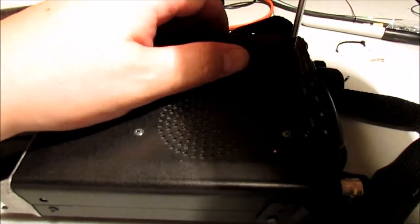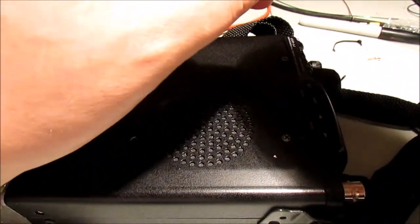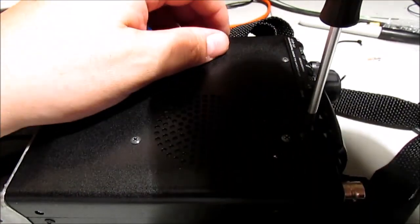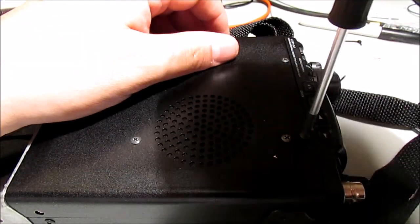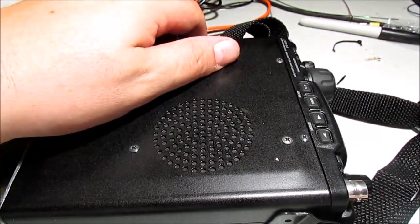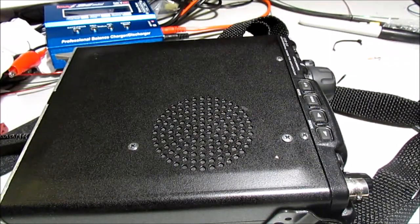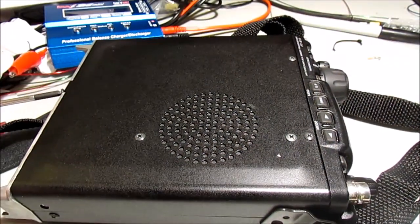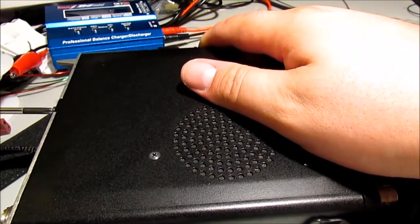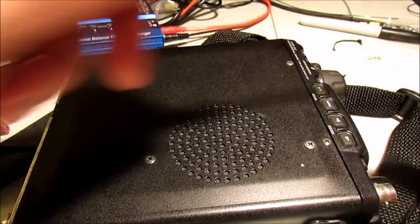Generally with screws, I have a tendency when I go to put them in to go backwards first and listen for a little click. I'll demonstrate that here. Like I'll put it in, I heard a click, then I'll go forward. That usually means the screw is now in the threads, so as to prevent cross-threading. I don't tighten these things down like crazy, either.